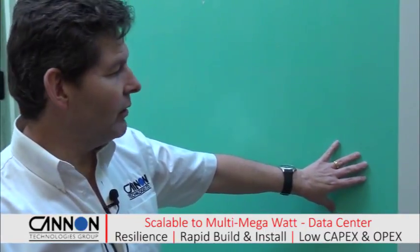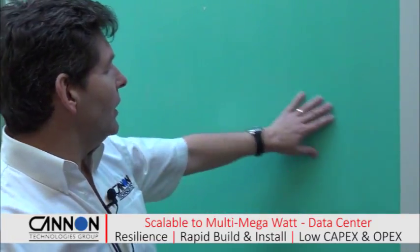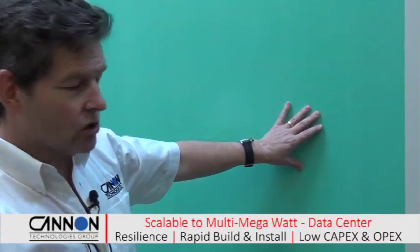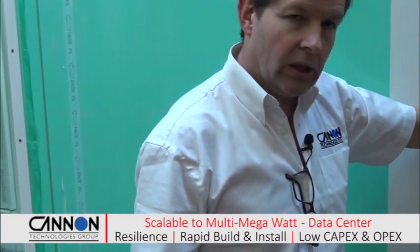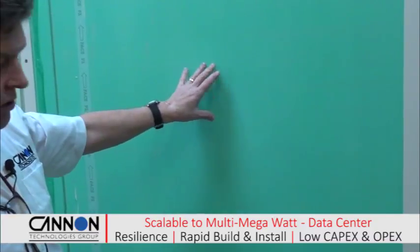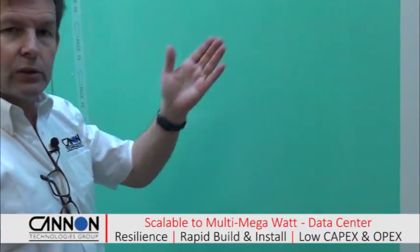The permanent temporary outer wall is rated at 90 minutes fire rating. We actually use 120-minute fire rated panels to get that rating. This green film is a protective cover to stop it getting scratched in transit. And this is installed when we get to site. So the modules are delivered in their entirety, 40-foot modules, and then we erect the temporary outer walls when we get to site, because obviously they will move as we expand each data module on days 2 and 3.